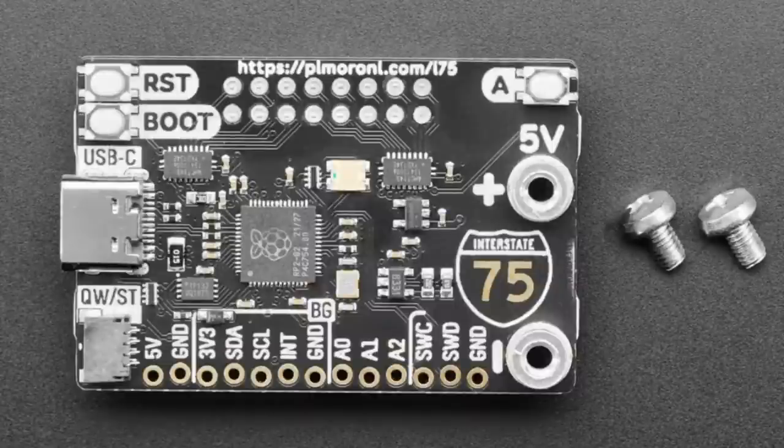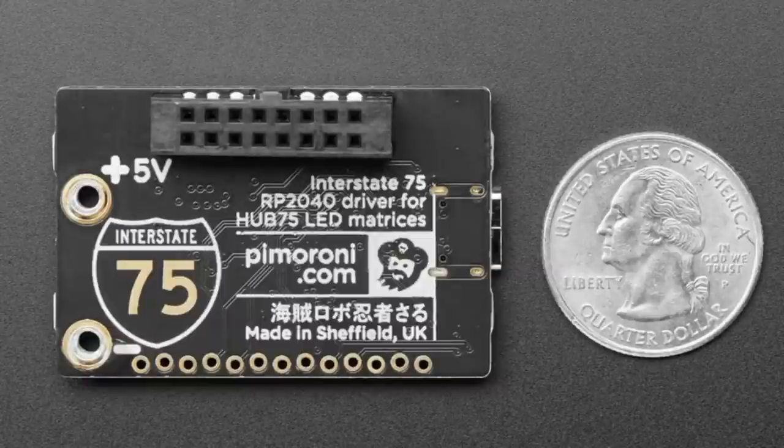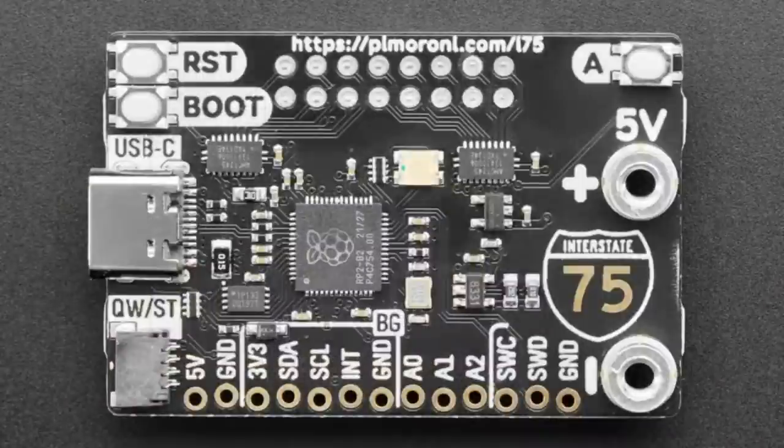So it's got a connector for a HUB75 standard, up to 64 by 64 size panel. It's got the E address. It's got some extra GPIO brought out. It's got power pins. You can power it via USB-C, which is fine. You can get a couple amps from USB-C. And, of course, you can always disconnect the power and connect it separately if you want to have separate power.